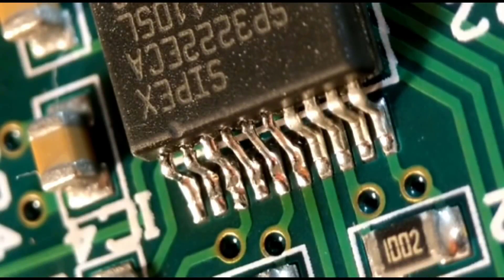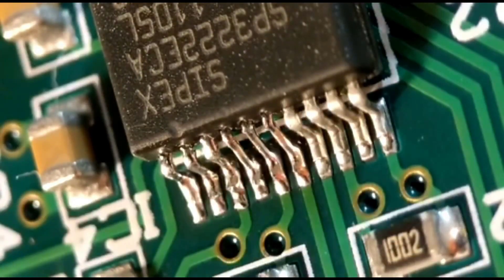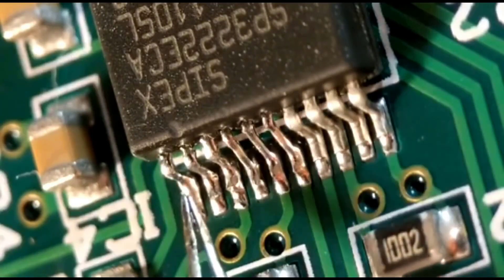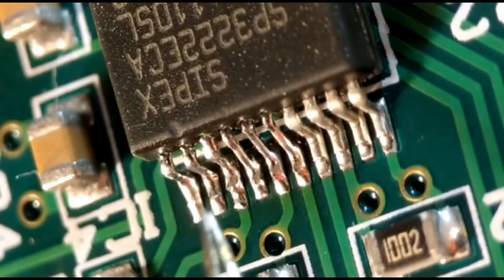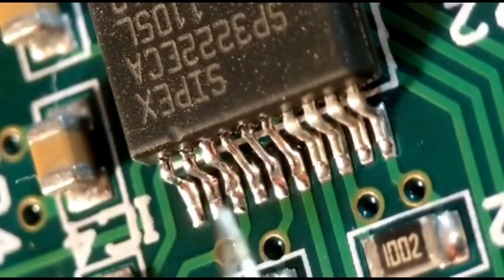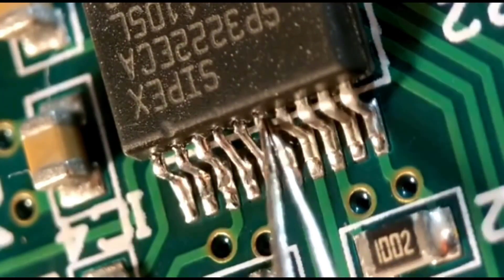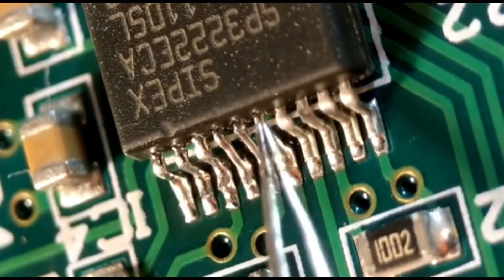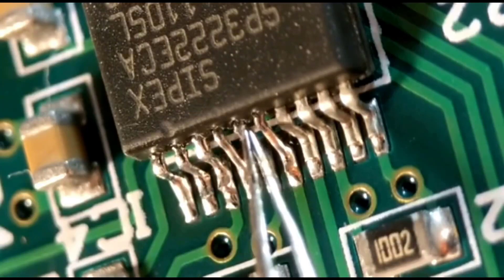This is the finished board. I repeated the operation for those two pins at the end, same as the other one, and went along the top and soldered them all up. As you can see, you've got nice joints right on the top and right down the bottom — three transplanted pins from another IC and three shaped like a pin from Kynar wire. The results are pretty amazing compared to what we started with. It's definitely worth trying if you've got an old IC you can't get a spare for — all you need to do is expose a little bit of copper to give you a base to work with.